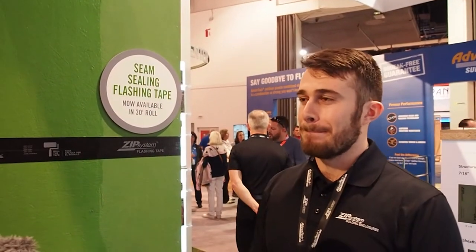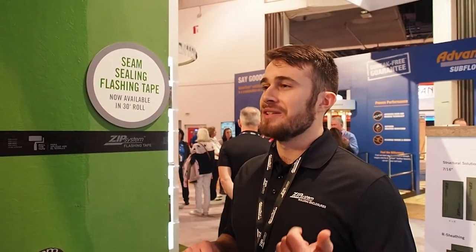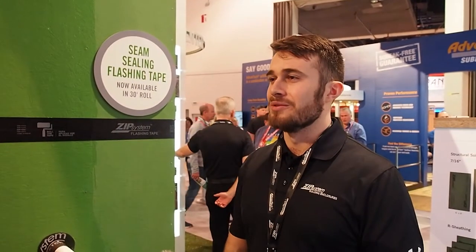That's pretty good. Can you also use that on roofs? Absolutely. All of our sheathing panels for Advantech — we have half-inch, five-eighths, and then the typical subfloor thicknesses of 23/32 all the way up to inch-and-an-eighth. All those products can also be used on a roof, and once you get into the thicker three-quarter-inch and inch-and-an-eighth products, we see those on flat roofs as well.